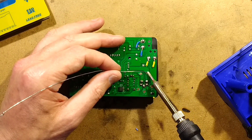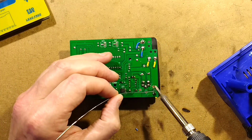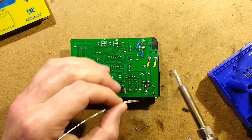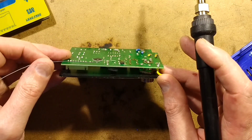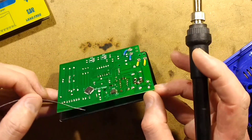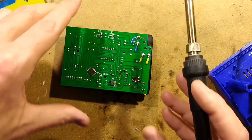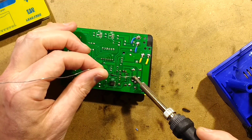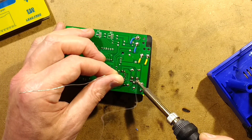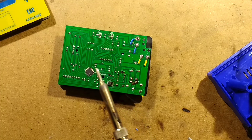What I'm going to do now is flow fresh solder onto these pads I've made, and then flow some more onto the existing connections. I'll have to be careful not to change the spacing too much, though I don't think that would actually do any harm. I'm going to flow fresh solder purely onto the connections of the connector itself. I'm using lead-based solder as I always do - it's better solder to work with, more flexible. That may also be part of the factor here.